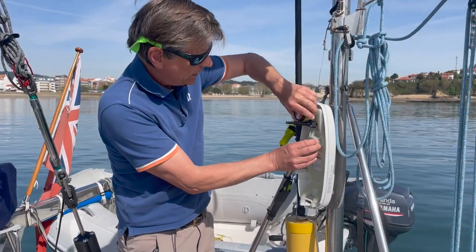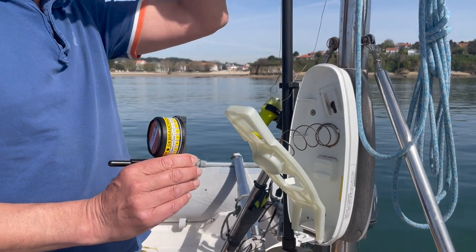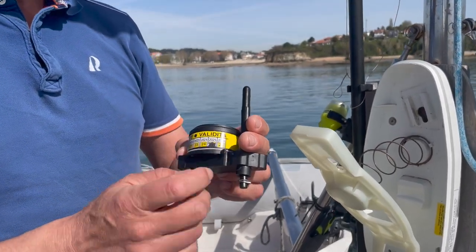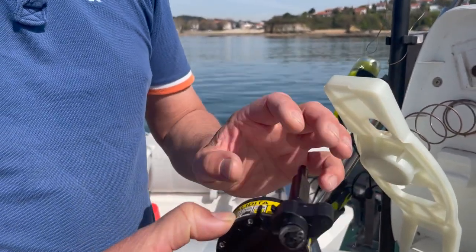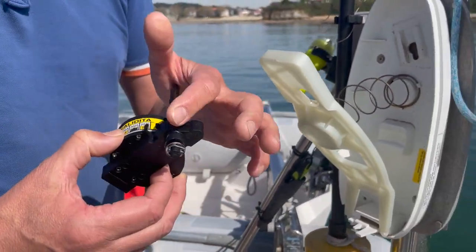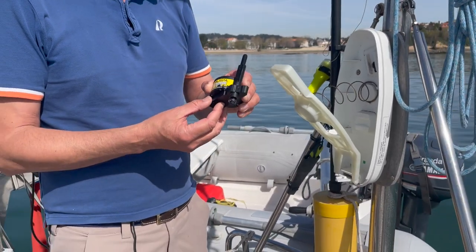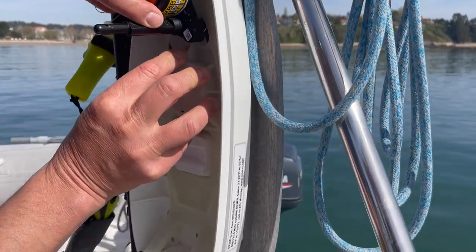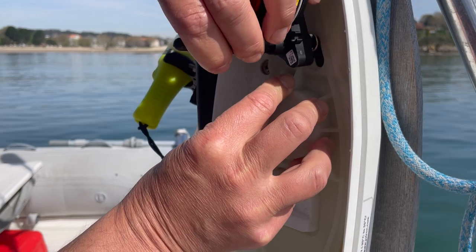The idea with the H20 is that it has a knife inside and it cuts a bolt, then a spring pops up. We can have a look at how this looks: when the bolt is cut, it pops up with this spring and the EPIRB floats free. This is the part you have to buy new every two years. You can see it's valid through 2025 because I've just changed it. You must buy the bolt original from Jotron because they are the only ones who supply this plastic bolt — don't ever use another type, as it needs to be weak enough to be cut by the spring. So I'll put this back.